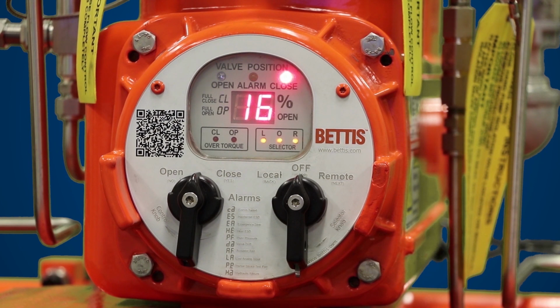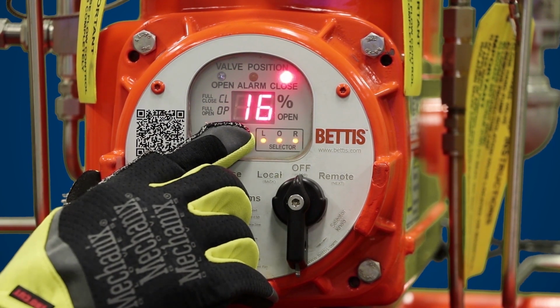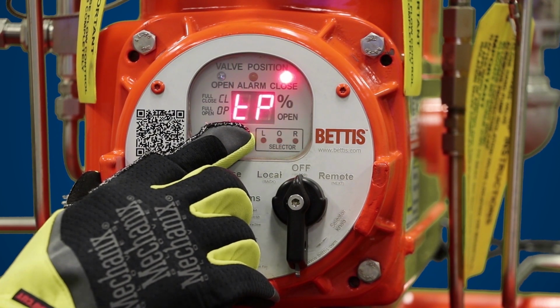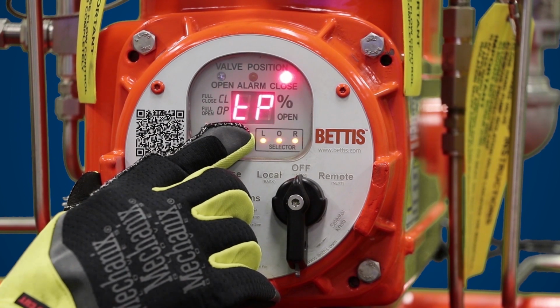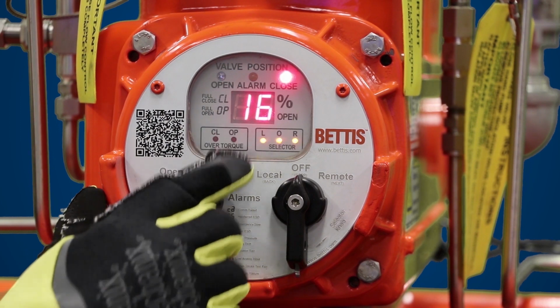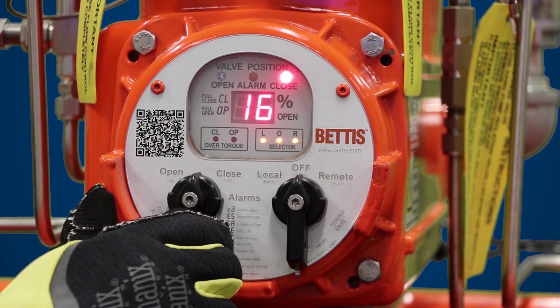If you have a thermal accumulator, the next parameter you'll see is TP. This is thermal accumulator pressure. For PSI, your selection is 5 to 50. And like the other 2 parameters, that equates to 500 to 5,000. This parameter is factory set and typically won't need to be changed. All right, we'll hit yes to go to the next parameter.